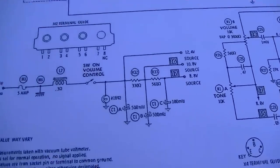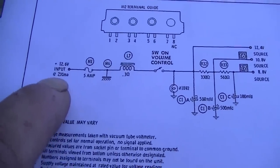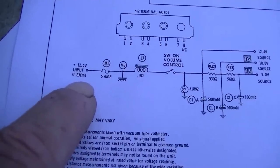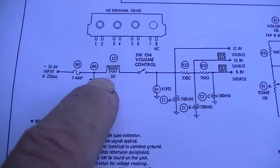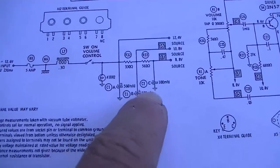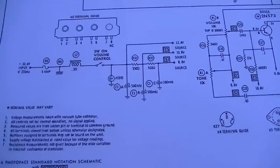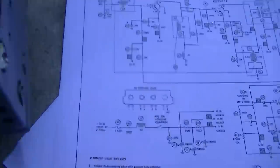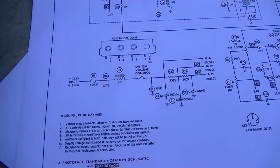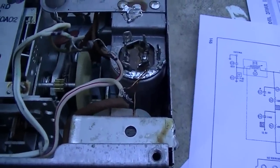If we look at how this capacitor is used in the circuit: we come in from the accessory — this car probably has a generator so it's going to be noisy — through a filter choke, on/off switch, and then we've got three stages of filtration. This one would also be considered a bypass because you're going to get some audio you want to keep out of the other sections. So this capacitor being good — and I'll admit I already bought two 470s — this is not diagnosing the radio.